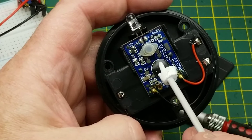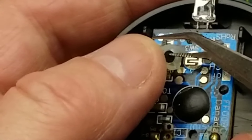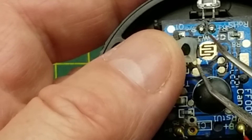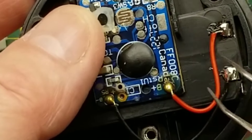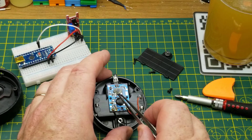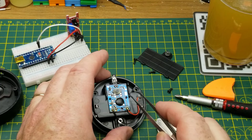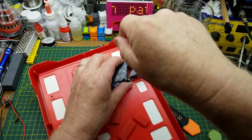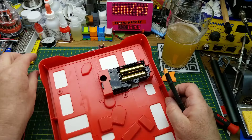It's not even much of a push button - just a little conductive pad and tracks on there that create a contact. It looks like that test point there is one side and the other side traces out to the positive voltage. So I guess all I need to do is connect that positive voltage to that pad and we can get a signal. I don't even need the full positive voltage - I only need about three volts referenced to ground, which I think I can get from the Operation game since it runs on three volts as well.